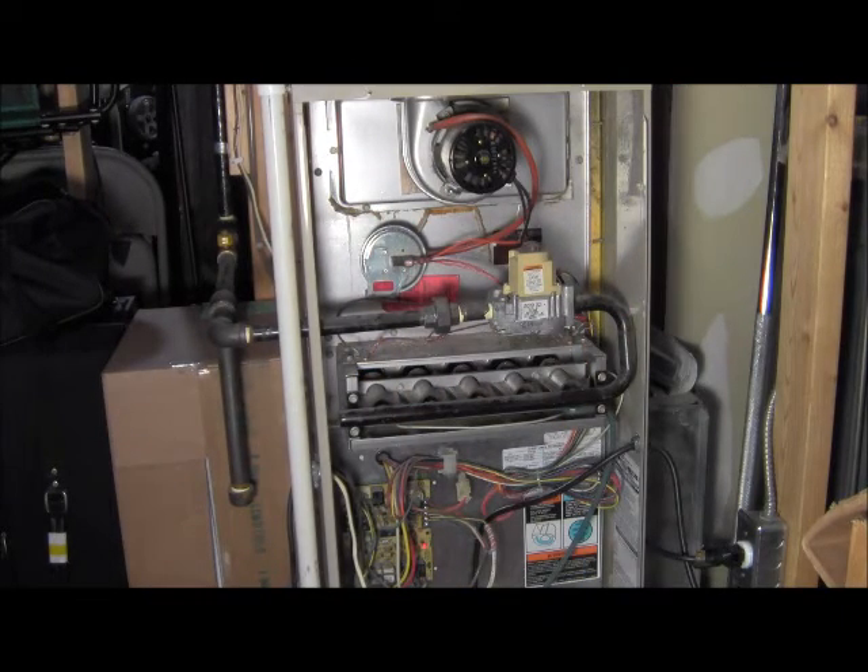So we have just shut off. See, our gas has shut down. Now our blower motor — our combustion blower motor, I should say — has just shut down. And now the last thing that is remaining is the indoor fan blower, and that will use the rest of the heat, blow it into the house, and once it is cooled down to a preset temperature, it will shut off the blower.